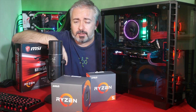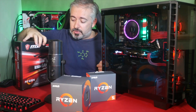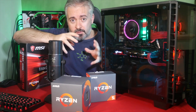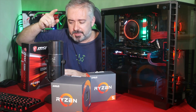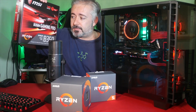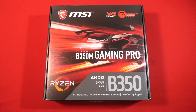the A series boards are the boring boards that none of us really are going to need to think about — they'll just be going in desktop machines for people to do accounting on. You can't even overclock at all on those boards. However, you can overclock all of the Ryzen chips. You know how Intel have got their overclockable ones and the ones they've got locked? AMD are just like, yeah, you can overclock any chip you like. You want a B series board or an X series board in order to overclock.